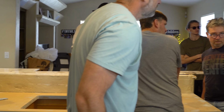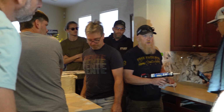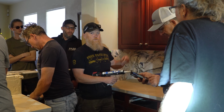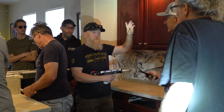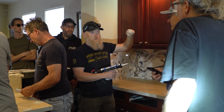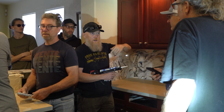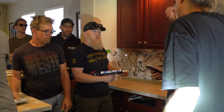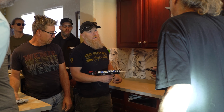It's our wall epoxy with exact matching color, so you never have to recaulk anything like that. And then you have epoxy on all your seams. I tape them all first because epoxy is a shit to work with. It's just like caulking when you use a wall epoxy. Then you smooth that out, peel your tape, and you'll have perfect color match seams. Are you smoothing it with a trowel or anything? Usually a glove and alcohol.